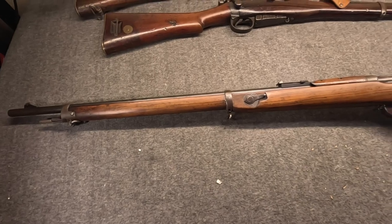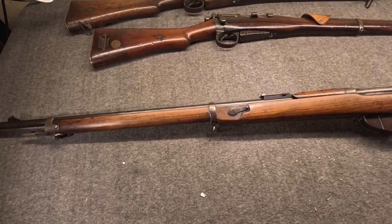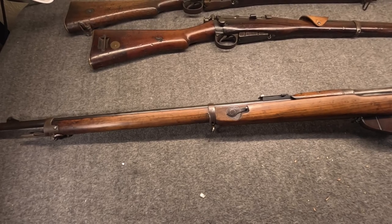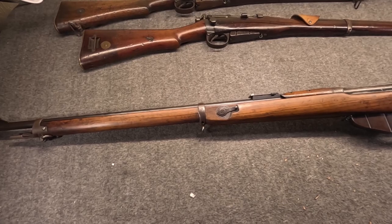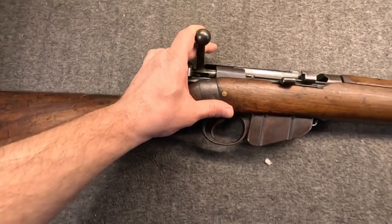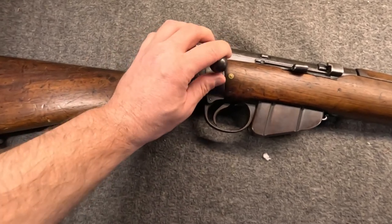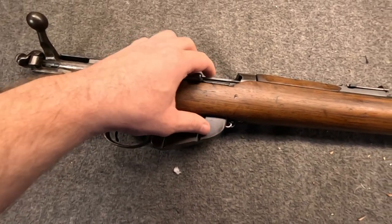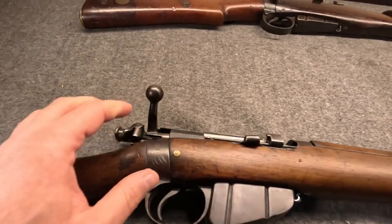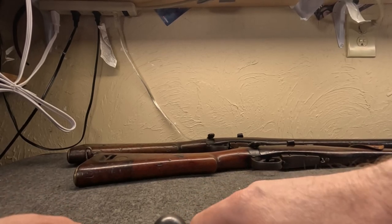These three gentlemen contributed and had a good black powder rifle. Unfortunately it would become a smokeless powder rifle using cordite, and was adopted in December of 1888 as the Lee Metford Mark I. Lee's bolt system was actually very strong for black powder, which meant it was adequate for the early smokeless. As we know today, it's quite famous for its rear locking system - the bolt only has to travel the distance of the cartridge itself, not the cartridge plus lugs. It also has only a 60-degree throw to turn it down versus 80 or 90 on other guns, and it is cock on close.